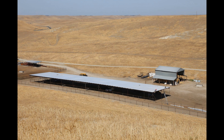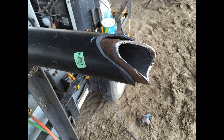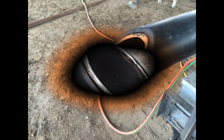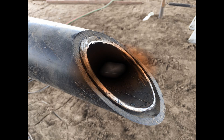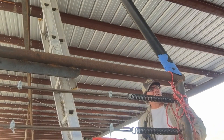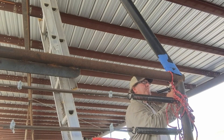For the most part we wanted to make sure that all the welds were getting the penetration they needed to stay in place. So through the use of some ABS pipe, I made a template so that each piece would be exactly the same as the last, and it cut down on prep time considerably. When you have to cut a piece and go back and forth to measure and fit, it can get very time-consuming.